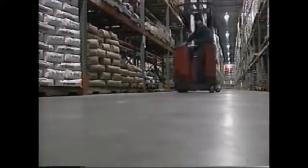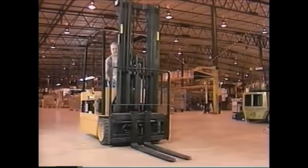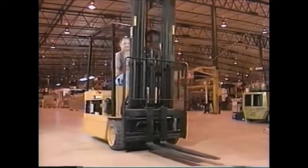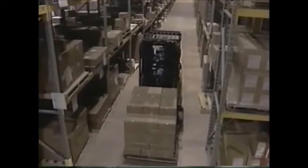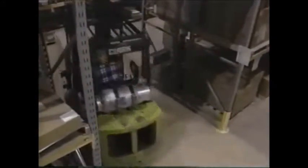In an indoor setting such as a warehouse, the floors are usually smooth. It is suggested that you raise the height of the forks about two to four inches. Always travel with the forks and the load at the lowest safe height. Bumps, seams, or uneven terrain along your route may require a slight fork adjustment. Always drive the authorized plant speed limit or slower, as good judgment would dictate. Keep your body inside the lines of the forklift — a hand wrapped around an overhead guard can be a pinch hazard. When driving a forklift, even an unloaded one, your visibility is restricted and you will encounter blind spots. Always check to make sure no one is in your path before moving.